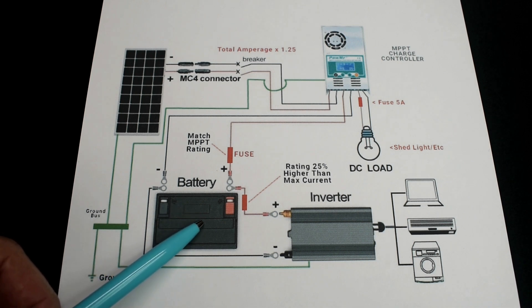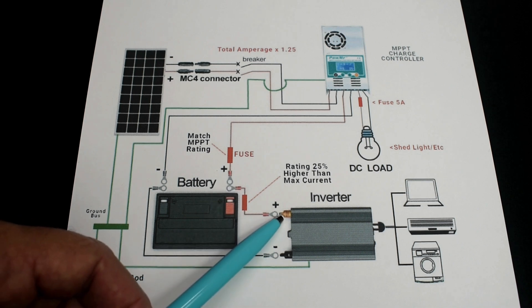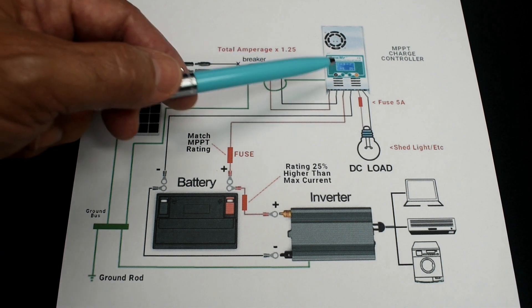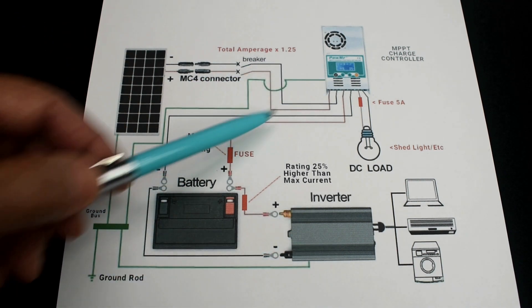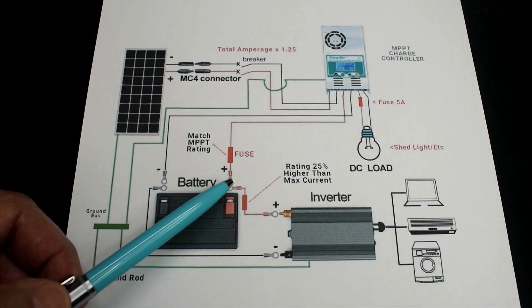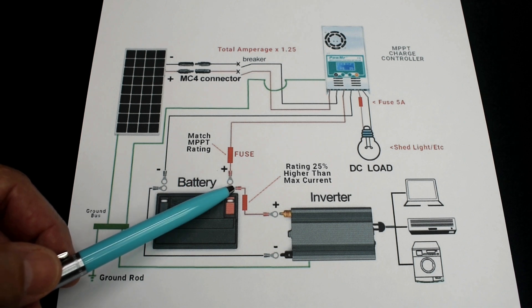The battery I'll be using for the demonstration is the 12-volt, 120-amp-hour lithium iron phosphate battery that I put together in another video. There will be a connection at the post leading to a power inverter, though for this demonstration I'm just going to have the solar panel connected to the charge controller and battery — no inverter. Besides the fuse at the charge controller, you're going to have another one at the battery positive going directly to your inverter. Keep that fuse as close as possible to the battery post.